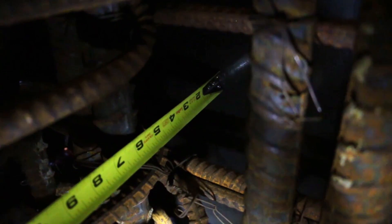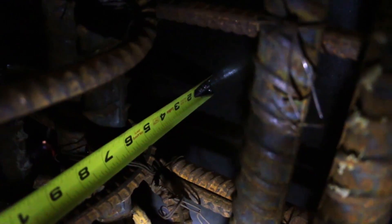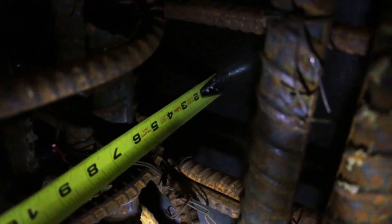Inside the column, you can see the vibrator in place for consolidation of the concrete as it's poured. The inspector checks hairpin bars that run through the column, verifying adequate clearance against the edges of the form — typically where issues arise. What they're looking for is a standard four inches of clearance. The inspector checks all the way to the top between the edge of the reinforcing steel and the edge of the form.